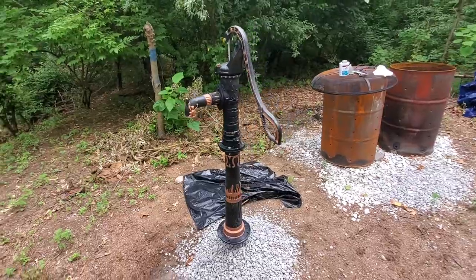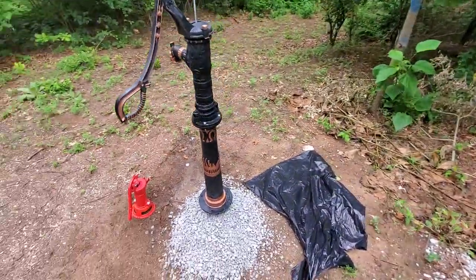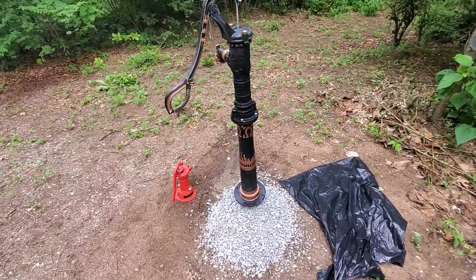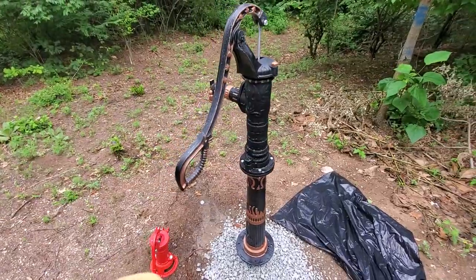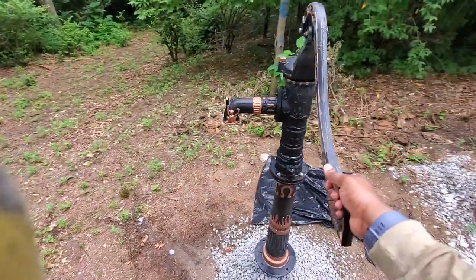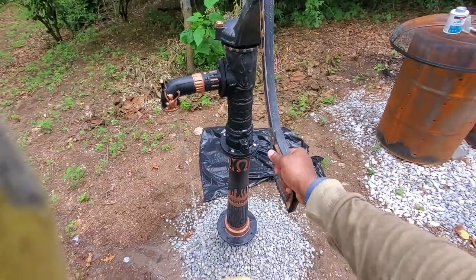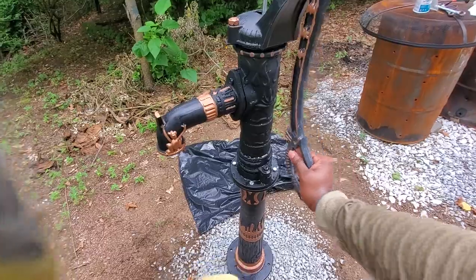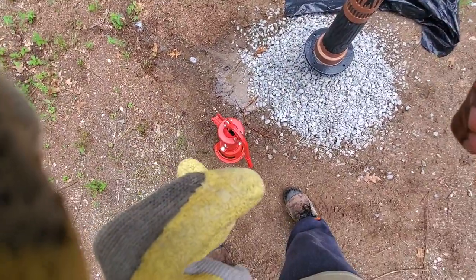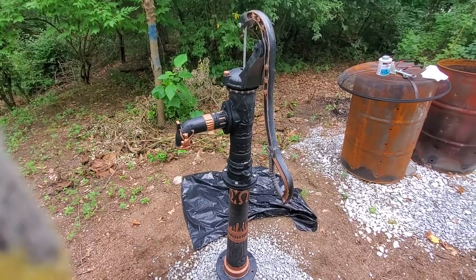As far as the pumps go — if you're starting out you can try the Water Source, but I recommend starting with the Vivor. If you've got more money to spend, the Bison pumps seem to be great. This is a shallow well — I'm right at about 23 feet, maybe a little bit more — and as far as I'm concerned it's working perfectly. Just wanted to post a quick review so people who need to install a shallow well have a nice little alternative to the Water Source pump.